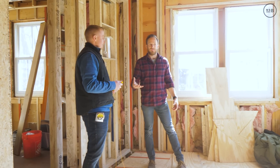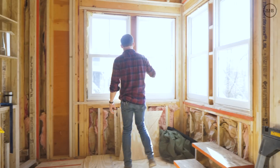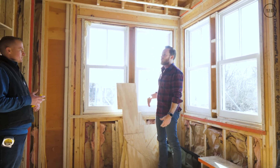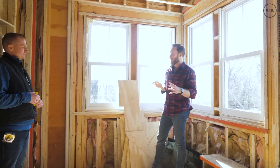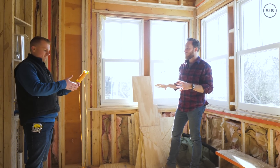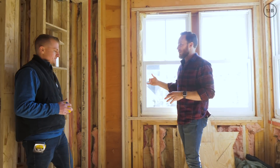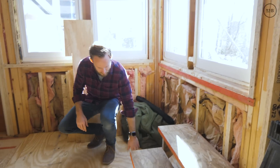This is a steam room — it has a tub, shower heads, and it's becoming a full steam room. We have windows in here, which is its own kind of animal. We're switching these to one big piece of fixed glass, and we're working with Rich Costa on really cool aluminum extension jambs that will get essentially glazed to the glass. The tile is going to die into the back side of it — it's going to be a really clean, modern touch. A lot of coordination especially on that waterproofing detail.